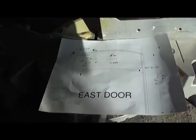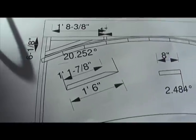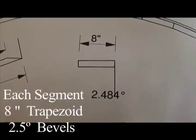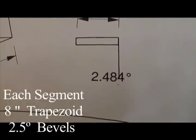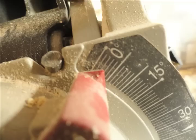I'm getting ready to do something I've never done before. I usually draw most everything out in pretty good detail, and then I start cutting pieces and seeing how it goes together. I chose to make the pieces 8 inches long, which makes the angle 2.5 degrees. Our accuracy on a saw like this is probably within a half degree, so that's much more than we need.